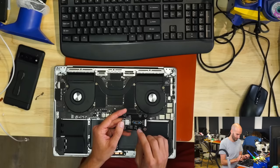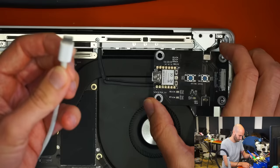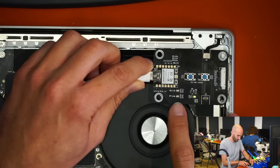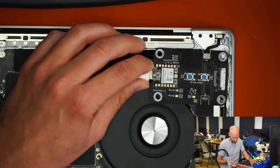I'll show you what these LEDs are for in a minute. I've connected the sensor directly to the NerdTool 1, and as soon as I power it up with a normal 5-volt power supply, two LEDs should shine. LED 2 should flash — it just indicates that the controller is working. If it doesn't flash, simply unplug and reconnect it. The second LED is more interesting, because it shows us that the sensor is not calibrated yet. This LED should shine as it's doing now when the lid is open, but it is closed — so it's not calibrated.